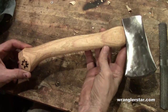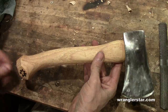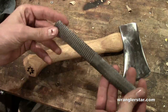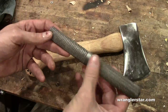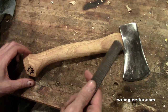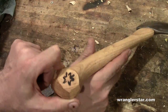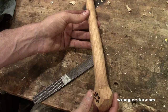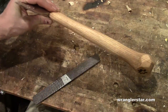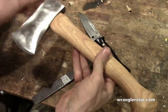Here's the finished product. I didn't bring you along for all the steps, but we've done that before — you can go back and watch step-by-step videos on how to make axe handles. One thing I did differently this time is I did the whole thing — apart from the bandsaw — using this rasp from my granddad's stuff. It has a fine and coarse side, a round and a flat. The round side in particular works great on all the contours. I really like the shape of traditional bushcraft knives, and I tried to mimic that with this hatchet handle.